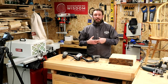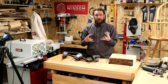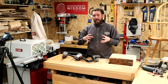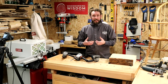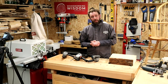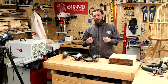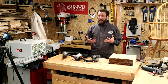Obviously, when it's wet, you're taking out a lot of the inherent stress in the wood. So as it dries, it's probably going to deform a little bit, whatever it is that you're making. It's likely to split and things like that as well. So you can use them on wet timbers, a little bit messy again. You wouldn't have all this dust in the air, which is a bonus. But you've got that fluffy material, and you've also got to contend with resin in the cleanup.